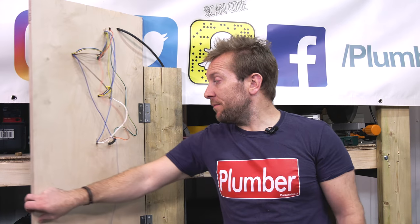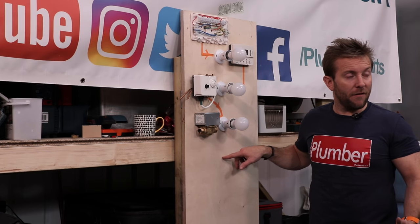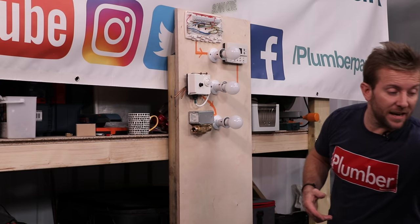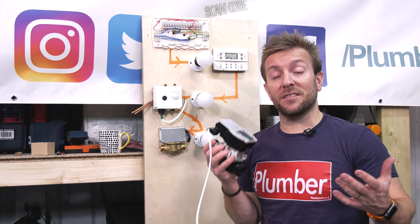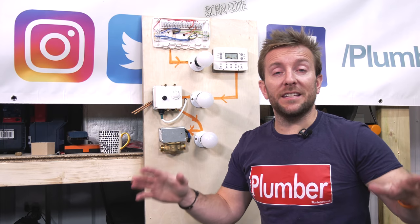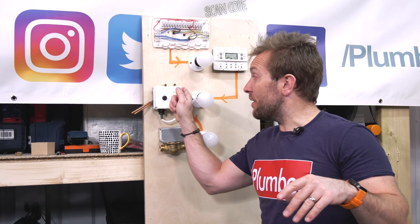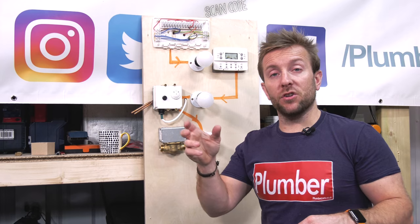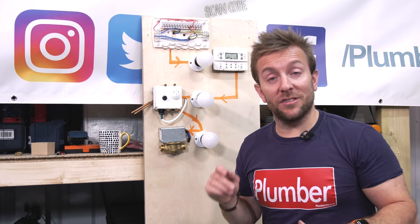So what I'm going to do now is put a light bulb just here. The switch live is now live and on. And then that will supply the pump and the boiler, and we're just going to have them together within the pump itself, because the boiler and the pump usually share the same live. The heating system works in exactly the same way. The radiator is working exactly the same way, apart from the fact that they don't have one of these, they have a room thermostat. That's where the switching goes on. But for now, let's get this little bit in here. Two seconds time, you should see that it's all done.